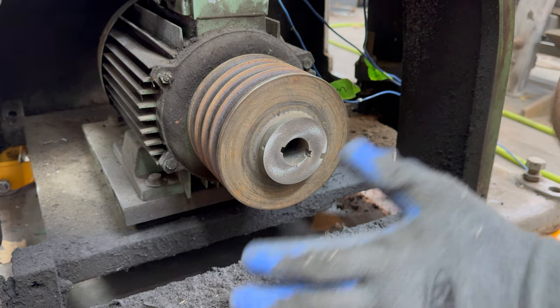Spindle speed changes made by double-jawed clutches sliding on splined shafts by means of levers on front of headstock. Impossible to engage conflicting gear ratios, and no interference devices necessary. Extreme simplicity, rigid construction, nothing to get out of order. Spindle and headstock shaft bearings are Timken, giving greater rigidity, greater precision, greater production without chatter, longer life, and greater power economy. Oiling by splash system. A cascade of oil floods every working part in headstock. Filtered oil supplied to Timken spindle bearings.